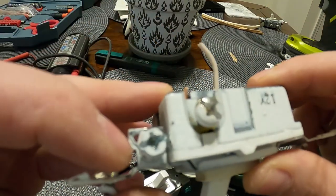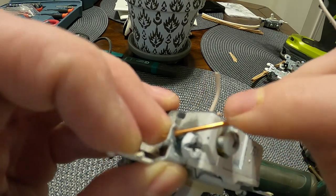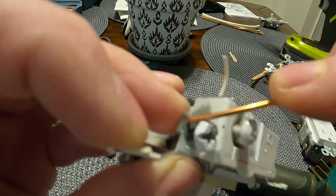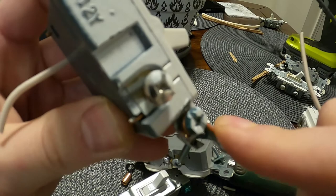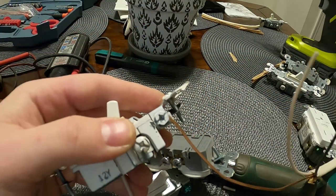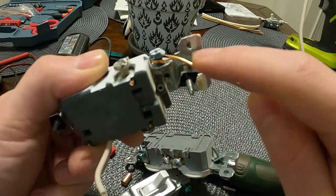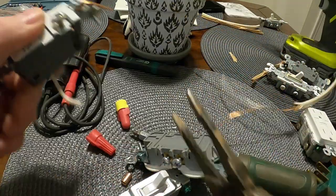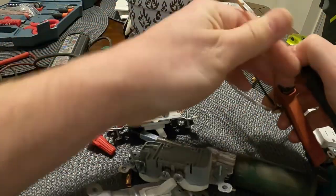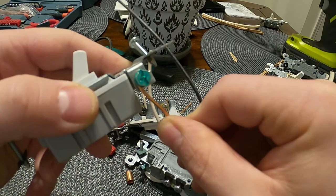I was about to show you what a switch does with the ground. When you have a switch, it's got a ground screw with a little hole there. If you don't have any pliers to bend your wires, you stick the wire through that little hole, wrap it around the screw, and when you tighten it down it tightens the wire down rather than loosening it. Same concept as the hook method, but that just makes it easier if you don't have pliers to wrap your wires. Or you can just do the good old bend and tighten it down.